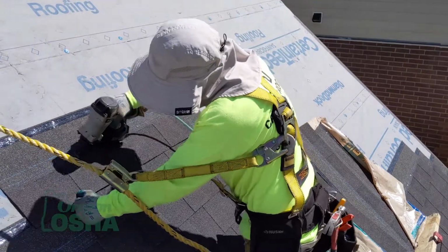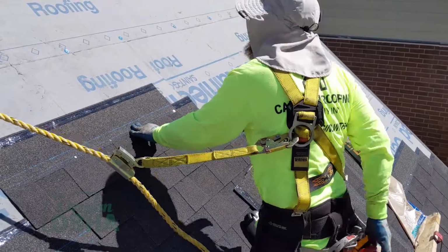When it comes to working on the roof with the different materials, whether it's asphalt shingles or metal or tile or slate, there are different aspects of each one that you have to be careful of. Asphalt shingles, when it gets hot, really hold the heat and can enable dehydration and heat exhaustion to happen. They get hot, you can burn your fingers a little bit. The granules are pretty rough, so if you lay enough shingles, you can actually wear through your skin. In wintertime when they're cold, they're stiff and rigid. If the wind starts blowing, I have been on roofs where the wind will actually grab the shingles and start popping them on you.